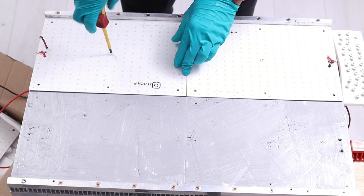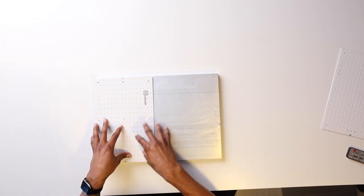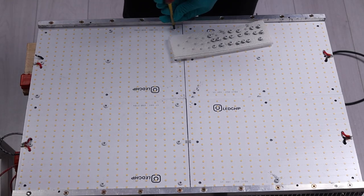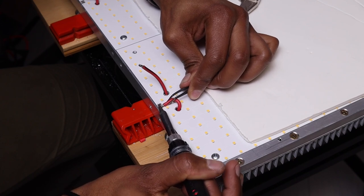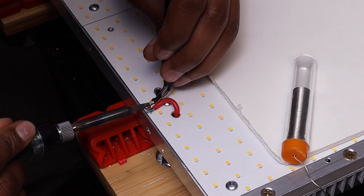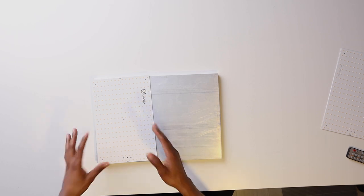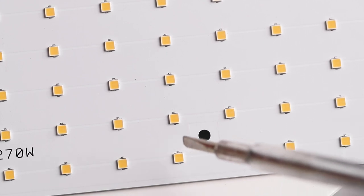The function of the thermal paste is to reduce thermal resistance during the heat transfer process — effectively transferring heat from the LEDs onto the heat sink. The wires can then be soldered onto the connection points on the LED board. Be very careful here because the solder pads are very small and close together, which is a massive design flaw. Also, if you need to drill holes in the LED panels for a bigger screw, be careful not to exceed the little square boundary or you might damage the LED circuit.